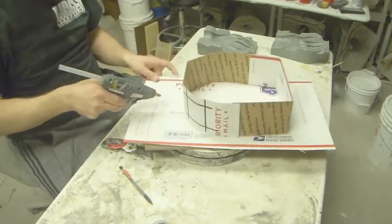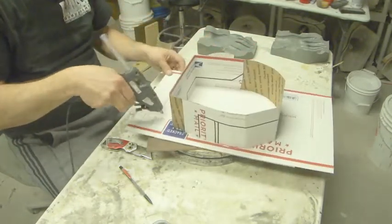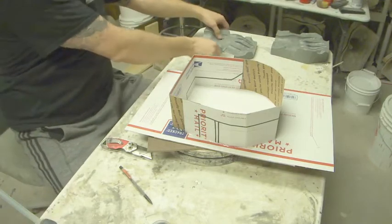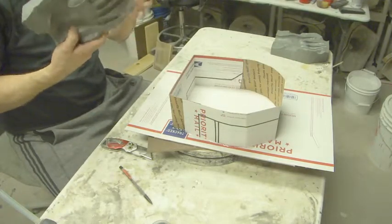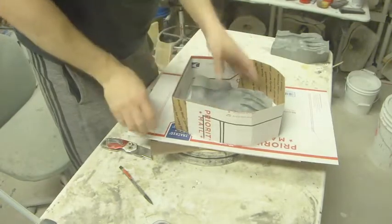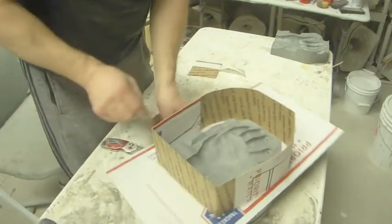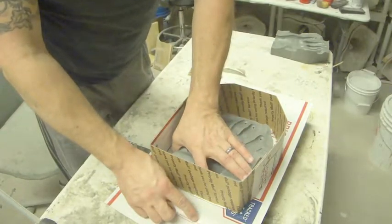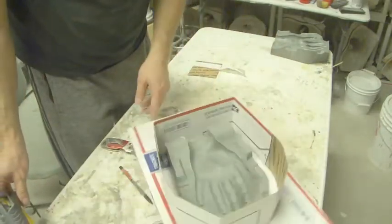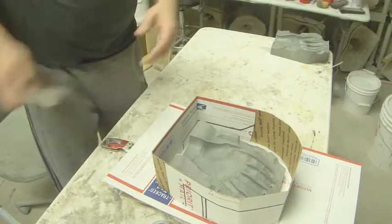Make sure that there's no room anywhere around the outside that's missing the hot glue. Okay. And now if we pop that in, you can see that there's a nice even amount of space all the way around, and that's going to make for a good box. So I'm going to do up the other one because I want to pour the silicone at the same time, and I'll come right back when we're done.